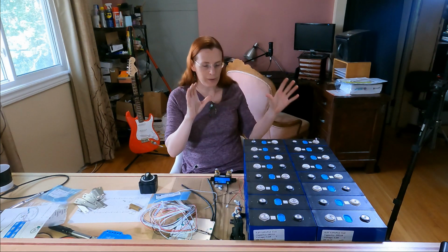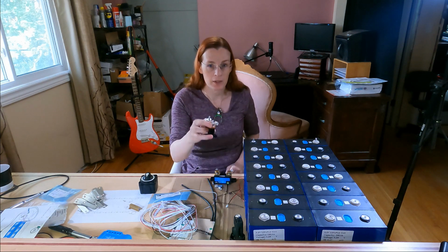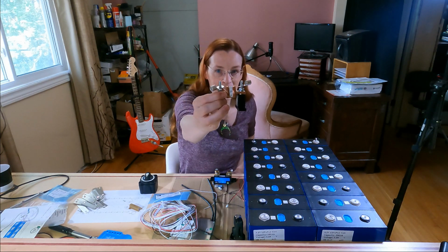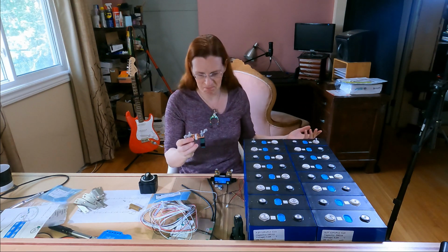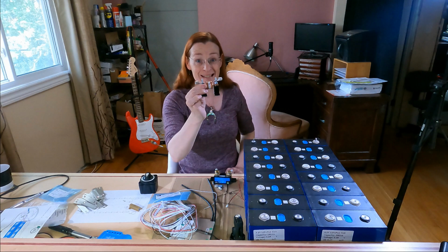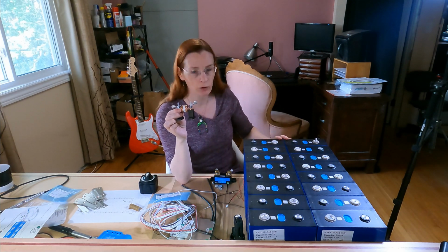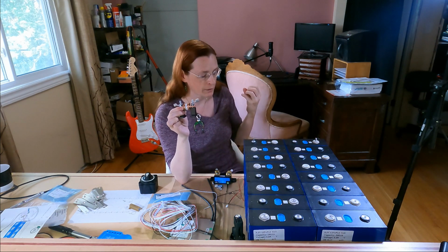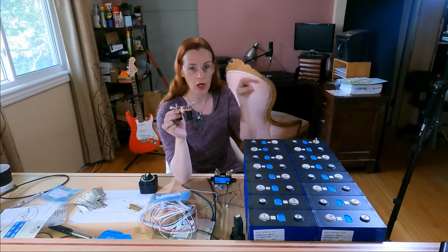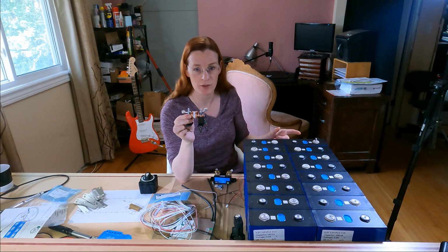Now, that's the basic design of the battery pack itself. We need to have, very first off, safety. So what this is here is what they call a T-class fuse. I'm going to keep saying this, but I didn't know what that was more than a month ago. A T-class fuse, these batteries have so much power in them that if you created a dead short, a traditional fuse would blow, but there's enough power that it could actually create an arc, a plasma arc, across the two fried terminals and not actually break the circuit.